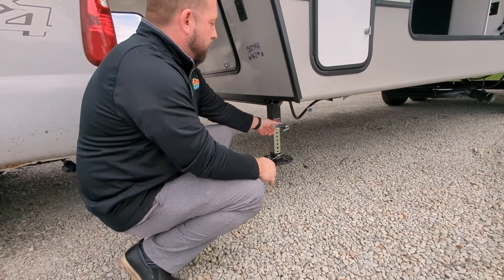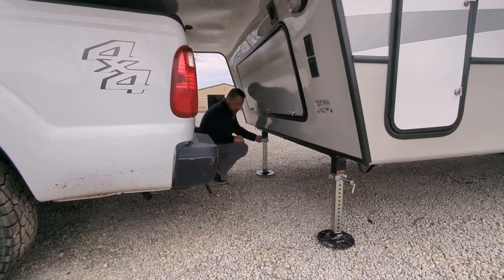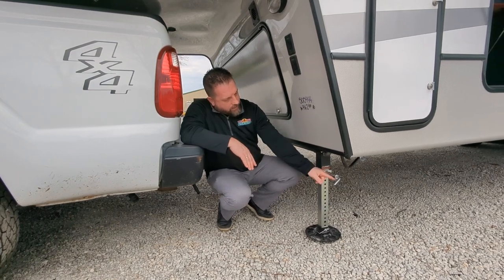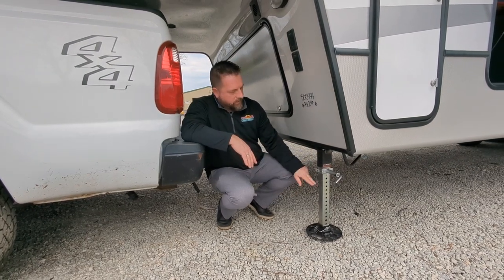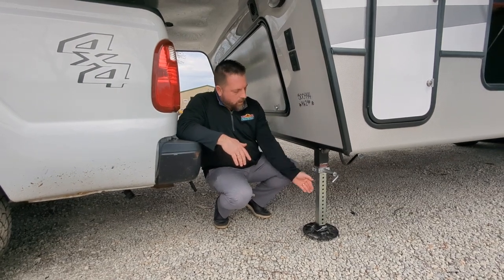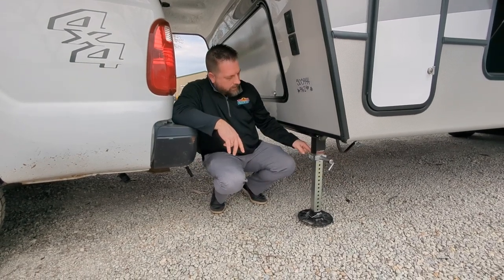We could go ahead and drop this to the ground and let it come up to the first hole, making sure that pin goes all the way through. The reason I do that: if that pin was sticking out but not coming through the back side, when I put the weight down it could bend the pin and damage the snap pin assembly, which would also make it unstable. It could eventually damage the leg too — it could even bend out the holes on the leg enough that it wouldn't retract back up. Then you'd have a hard time retracting the legs to take it down the road. You always want to make sure the pin goes all the way through and you see it on the other side.